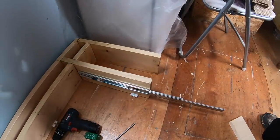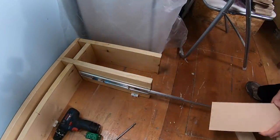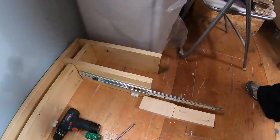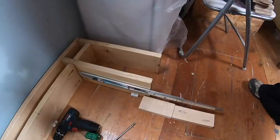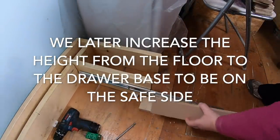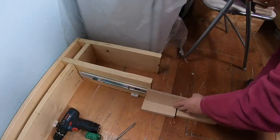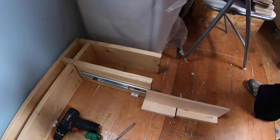Right then. You get the drawer out of set then. Yeah, so if we pull that out. And our floor's going to be, I think it's 22. I can't remember if it's 22 or 18 mil. The floor. Yeah, so if we use those blocks, we're fine because the front drawer fronts will go clear of that, won't they? Yeah. And the bottom of the drawer will clear the floor. Yeah, and so if we just pull that out and put that on there, that should work out right height wise.